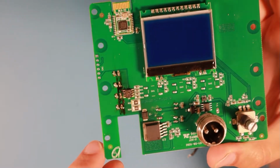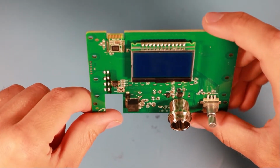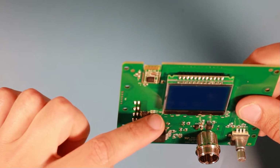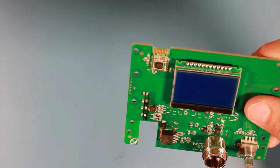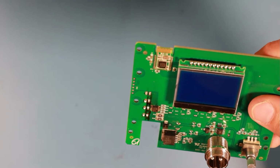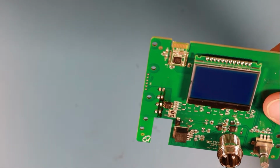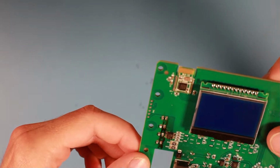Yeah, but I think, yeah, maybe. So this is the position. The PCB sits inside the light when the light is in use. So I think the heat from the regulating IC rises up on this PCB and in the air, and then this small IC which somehow selects between the different color temperatures gets too hot, and at least in my case it melted down. Perhaps there's also another failure point. Perhaps the LEDs drew too much current, but then the overcurrent protection should be reacting on that. I really don't know.